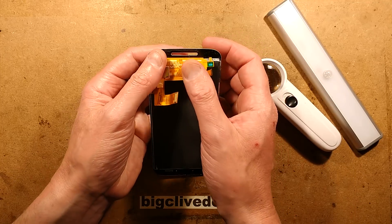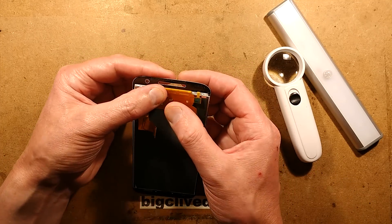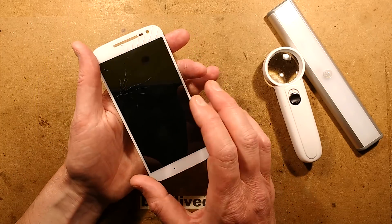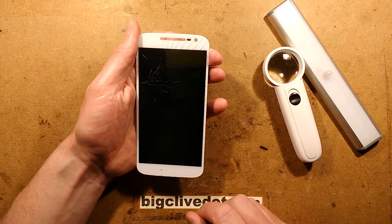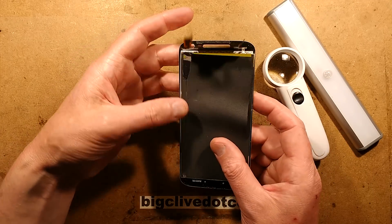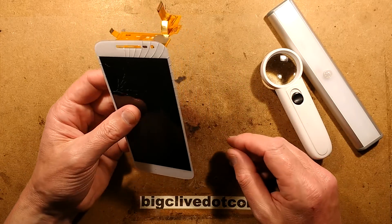The screen has multiple layers of plastic film — you have to bend this back quite tightly, then fold the side wing in quite tightly, then fold this through. I don't like folding these plastic ribbon cables because it's very easy to crack them — I've done that in the past. For the replacement I folded them very gently, put on all the adhesive die-cut layer that sits in the phone frame, checked everything was working, then peeled off the layer and stuck the screen in permanently. At that point it decided not to work because it was very slightly off alignment — the angular pressure on the click-down connector was stopping it. Once I got it working, the glue around the outside was knackered so the screen isn't terribly well stuck to the phone, and very occasionally it sort of pops up, so you may hear a crack noise as it pops off the frame.